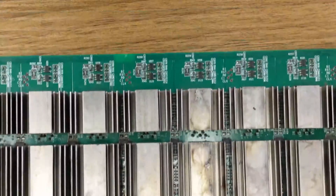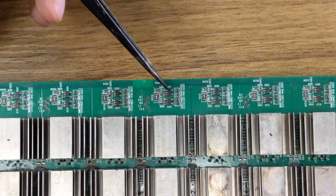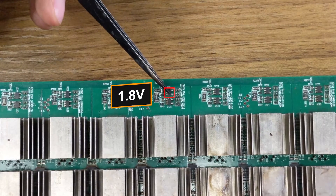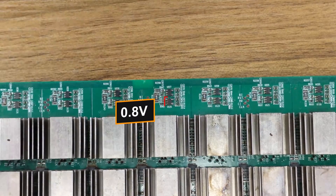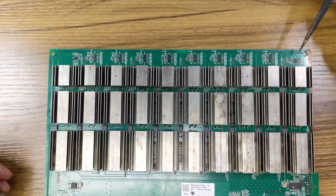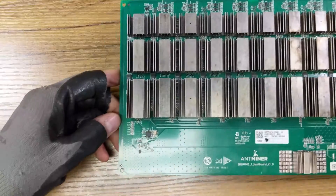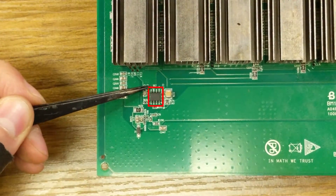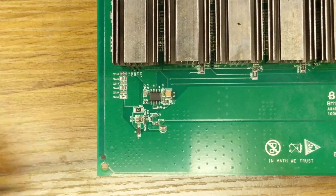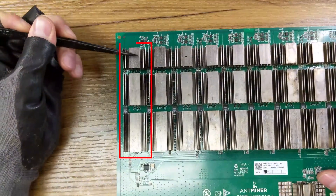If we take a look, there are two of them — that one being the LDO 1.8 volt, and that one being the LDO 0.8 volt. They are all pretty much the same, except that one down here, U17. That LDO is linked to the boost circuit, giving power to the last domain.